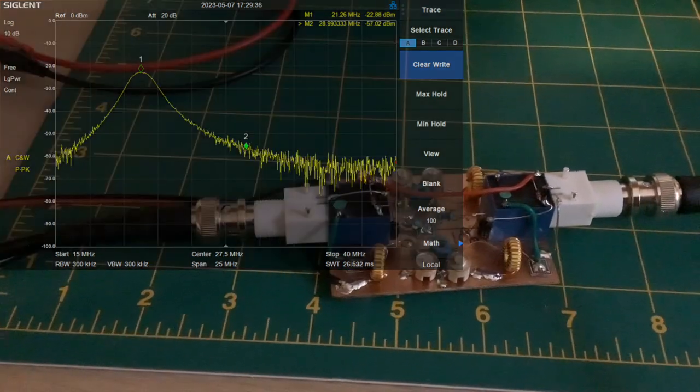The bandpass filters are indeed switching. I'm aware I haven't given you the full story — the final piece of the jigsaw is getting that bias provided by the Arduino itself rather than the power supply. I'm going to save that for probably the next video, when we'll be looking at the multi-function VFO — the variable frequency oscillator — powered by an SI5351 and an Arduino, which will do that and quite a lot of other stuff, including switching the filter. I'll be able to show you the code and make it available for you to tinker with. I hope you found this interesting — thanks ever so much for watching, catch you on the next video, bye-bye, 73.